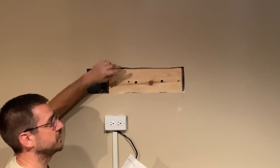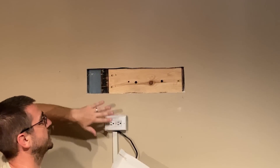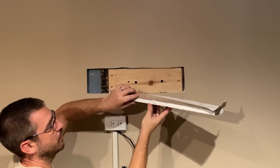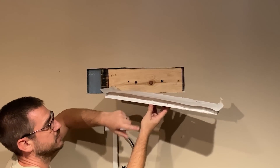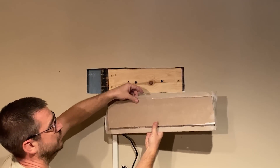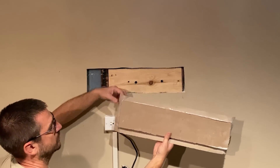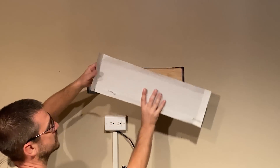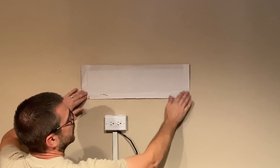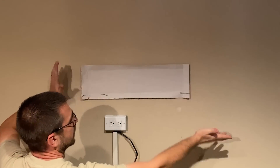I've got a two by six screwed into the cement block behind it, as well as screwed into both studs on each side. Now I'm going to patch this drywall back up. I had to run to Home Depot and get a patch — a piece of drywall — because I only had half inch here; this is actually five eighths drywall, which is a lot thicker. What I usually do with these patches is cut the patch out of the drywall larger than the hole, then peel the gypsum out of the middle. It leaves paper wings on each side — once we put this in, it fits nice and snug, and leaves paper that I can mud underneath so it sticks. Then I'll feather this out and make it look real nice and smooth.